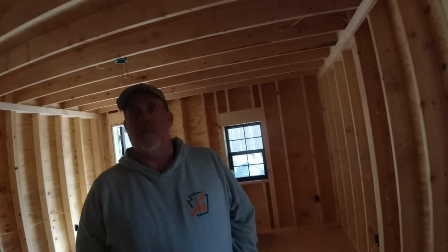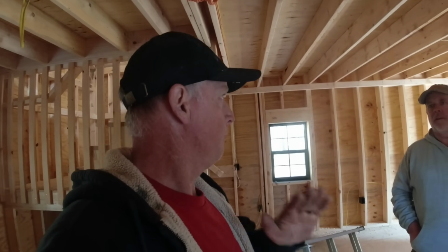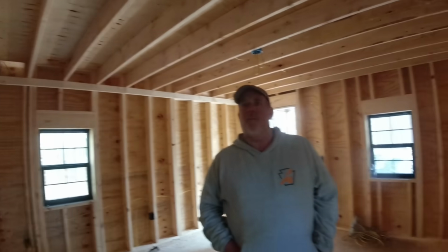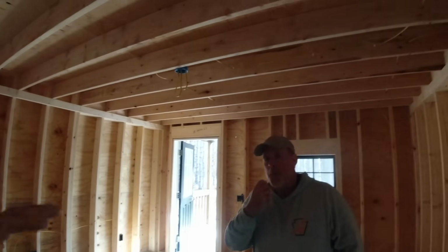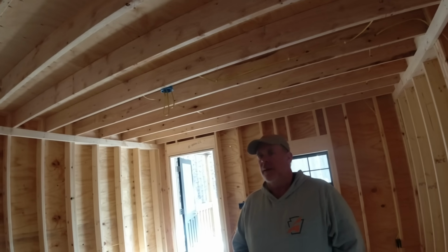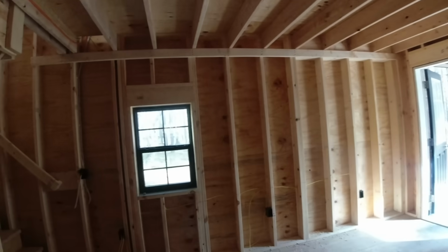I did that 30 years ago, and they said it would never work. An old timer told me to do that. He said put a deep well pump in and put it on a 45-degree angle. Don't lay it on its side because it'll burn up. So on a 45-degree angle 30 years ago, it still works. Here I have two 300-gallon tanks on each side of the downspouts, and they connect underground with a pump in one of them. And I never run out of water at the shop. Of course, we don't drink it. It's just for washing trucks, which the guys don't even wash their trucks anymore, so why would we run out of water?